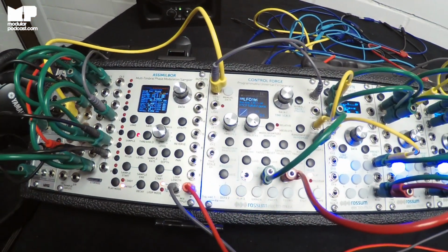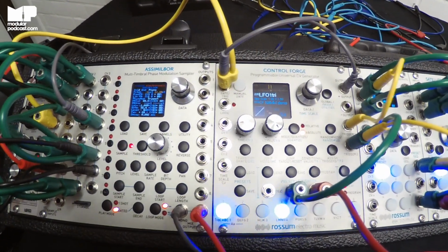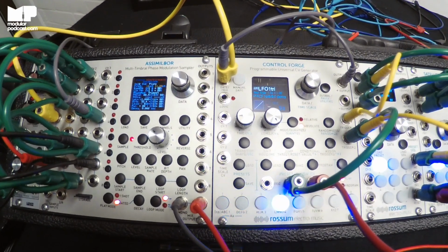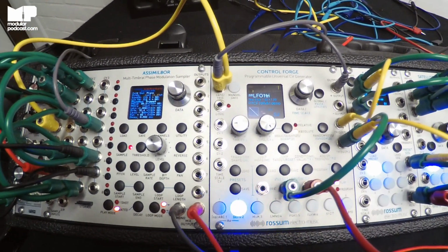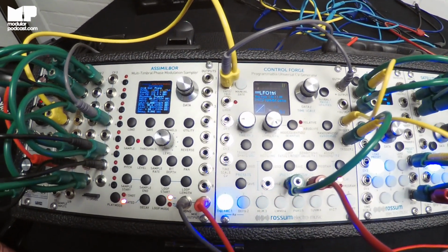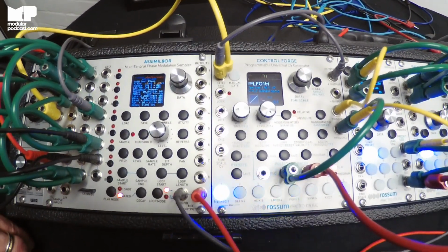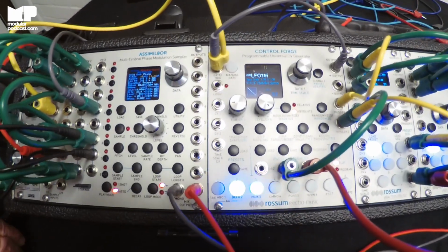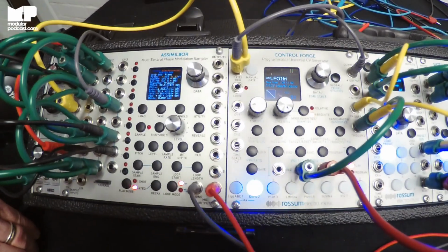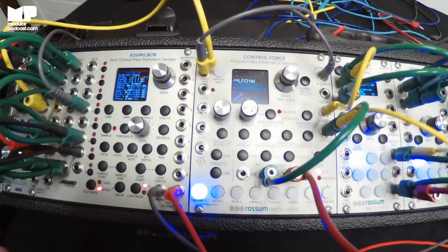Now, in the mock-up here, it's limited, but the final pitch shifter is really an exceptional piece of DSP, and it'll be able to pitch shift all the way up to 5 octaves upward and 15 octaves downward. So you'll be able to play around a lot with really interesting effects on the pitch, including taking sounds and bringing them down into control voltage frequencies and so on. You could, of course, take it really down, get that really grungy, several octaves shifted down, patch it back into another channel. I mean, having 8 channels, you can patch it stereo back in to sample itself. Right, exactly. So there's a whole lot of stuff you can do like that.